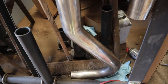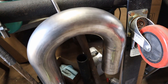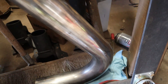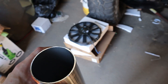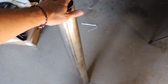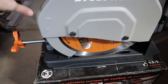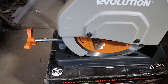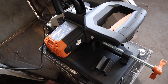For the charge pipes I have a three-inch stainless steel tubing — this one has a pretty good bend to it so I can cut what I need from the different angles it has. I also have a good section of straight three-inch stainless that will help on the straight sections, since the driver's side charge pipe has a good distance of straight pipe. To cut this tubing I went ahead and purchased a cold saw — I've already tested it and it cuts straight through super clean, and you can basically pick up the tubing right after cutting without burning yourself. This should save me a lot of time on prep between cutting and welding.